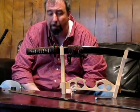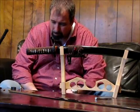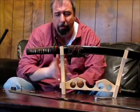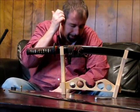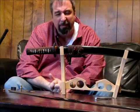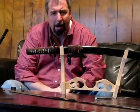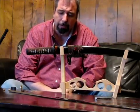It's got a lot of carbon, it gets very hard and becomes brittle. A good steel, the first, step back a little bit. The first numbers in a steel, like say 1050, 1060, 1045, the 10 is a series of the steel. Steel is an alloy of iron. And they alloy this with different metals.